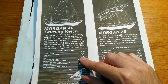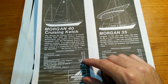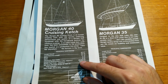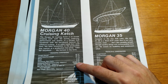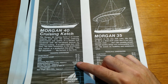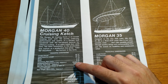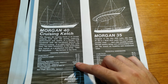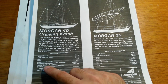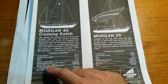It's a shoal draft, pretty shallow at 4 feet 2 inches, with 6 feet 5 inches of headroom and 22,000 pounds displacement. What I learned when moving the boat is that displacement is very close to the actual weight of the boat out of the water, and that includes the keel weight — so the 8,000-pound keel is included in the 22,000 pounds. Now the brochure says cast lead for the keel, but ours looks like poured concrete with ball bearings mixed in.